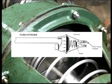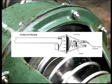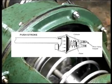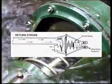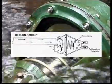The water pressure inside the diaphragm chamber increases, causing the diaphragm to extend and the piston to move forward in the piston bore, forcing water through a non-return valve and up the delivery pipe. At the end of the push stroke, when the energy is spent, the pressure in the diaphragm chamber drops and the exhaust valve springs open.